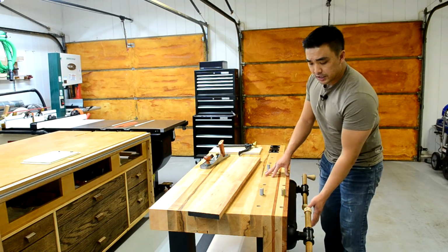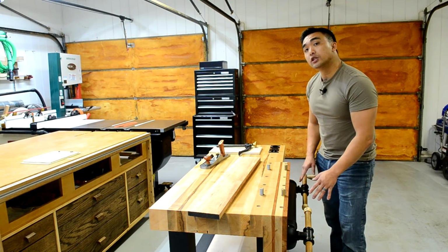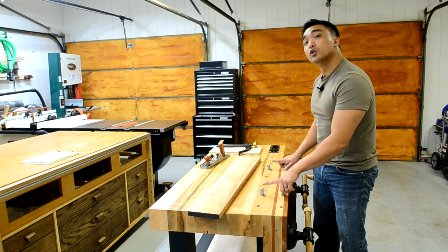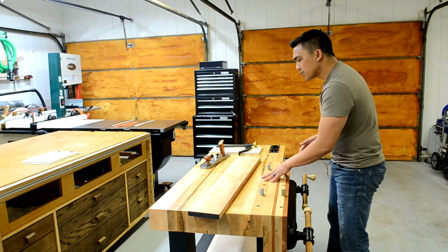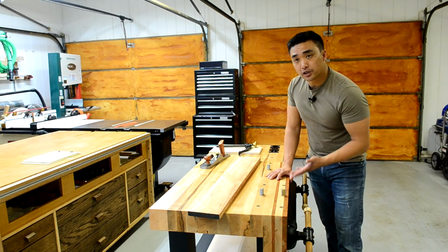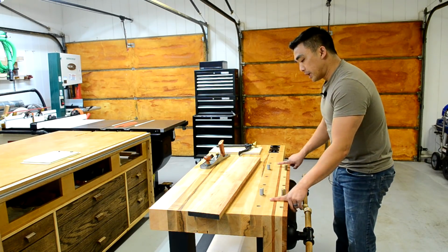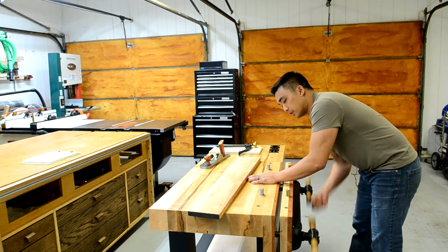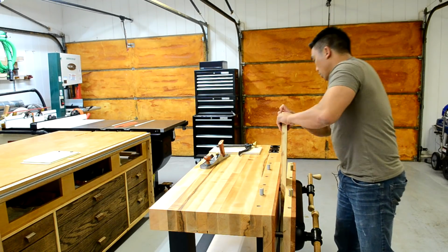The only issue was that it was missing the front cover, and the chain that came with this twin screw vise was used to accommodate the 2 screws 16 inches apart on center. So I bought a 24-inch cover kit, which actually came with a chain to accommodate 24 inches separating on center of the screws. The vise works flawlessly. And better yet, it is an extremely strong vise.